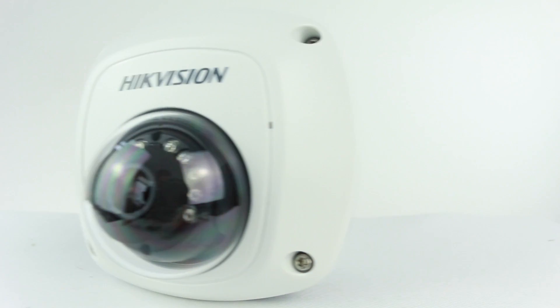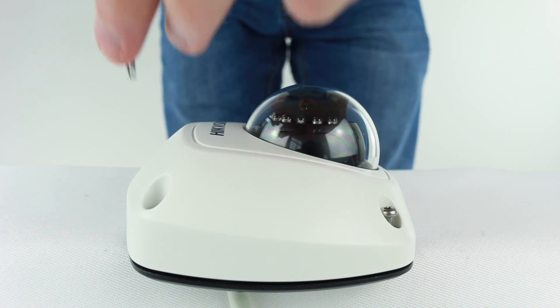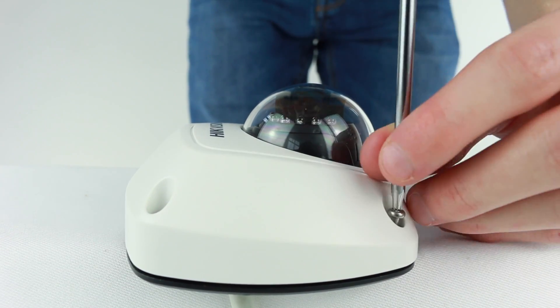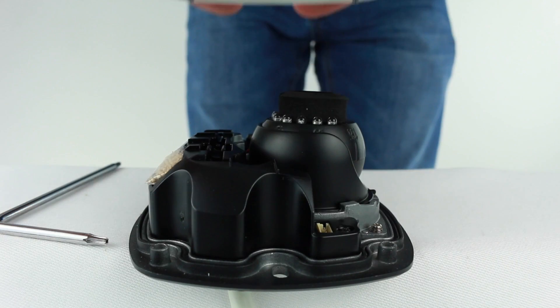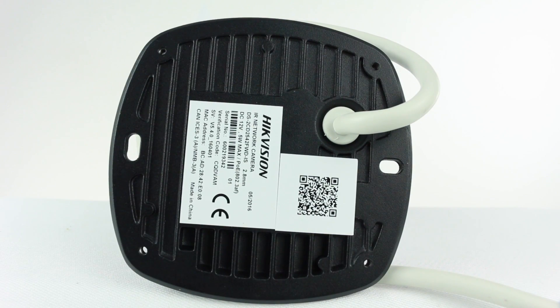The camera is simple in design with no ports on the back and easy to install with two simple screw holes. When you wish to access the inside of the camera, this is easily done by taking the hex tool and unscrewing all four screws from the front of the camera, then the front cover should simply lift off. Once open you will be able to clearly see the two screw holes on the back that you can use to mount the camera to the mounting plate.